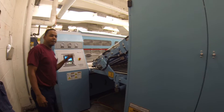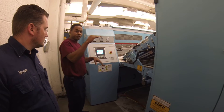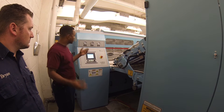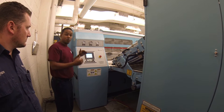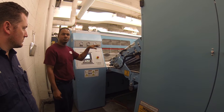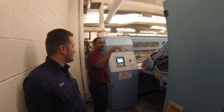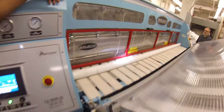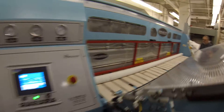When the Ironman stops, the good thing about it is it has a setting that the roll will come up just to be off the chest, so we can save our roll and keep it in good shape longer. Basically you don't have to go manually and bring it up — there's a setting there. If you want to go higher you can change that. Right now we have it on a timer, two seconds. Whenever you stop the machine, it goes up for two seconds and stops. So right now you can see it's off the chest — it's safe there.